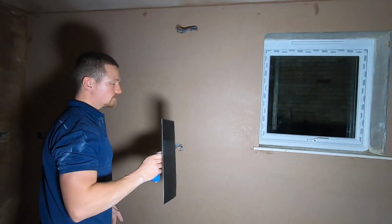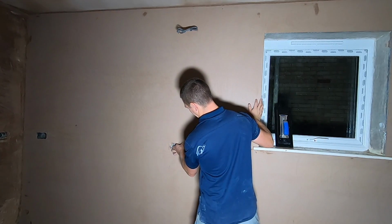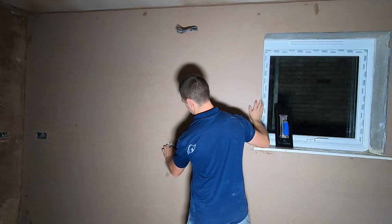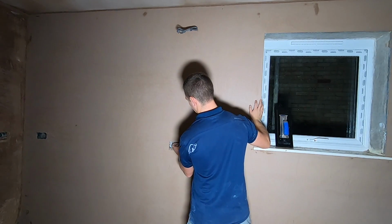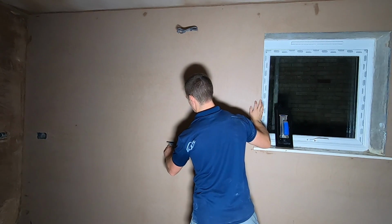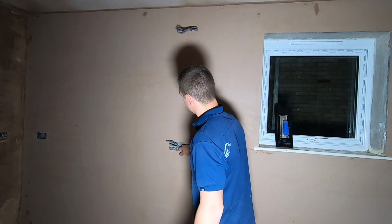And that's it. Actually, it's not it. Now is also a good time to clean out your back boxes if you have anything in, whilst the plaster is still soft. Push it in, push it towards the box, empty it, get it away from there, and then bring your cables out. Bring them out, get them ready for the electricians, and then do that everywhere else. Nice empty back boxes, don't want to annoy anyone. So, that's it, the full process of plastering.